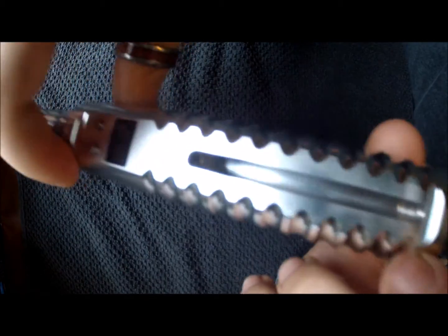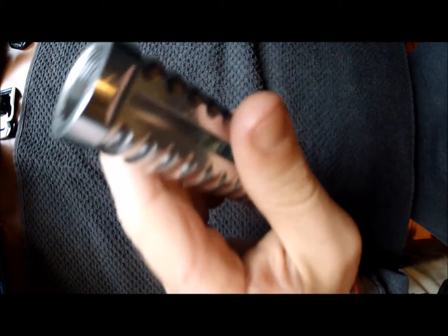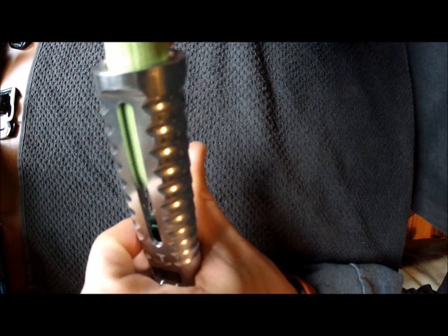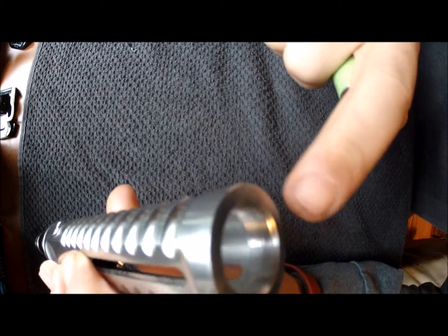And that caused me to do a little more research, and what I ended up doing was looking down the battery tube. I don't know if you'll be able to see it. You probably won't. I'll just end up hitting the camera. But in the bottom of the battery tube, most APVs, like the SIDs, the VAMOs, all of those, had a plastic protective disc that went between the chip and the battery. This one does not have one. It has no protection. So when you drop that battery in there, you're literally putting it on the end of that chipset. That, I would say, is my biggest complaint about this mod.